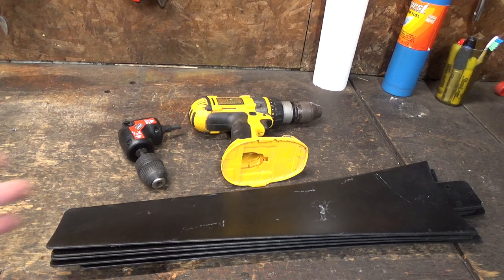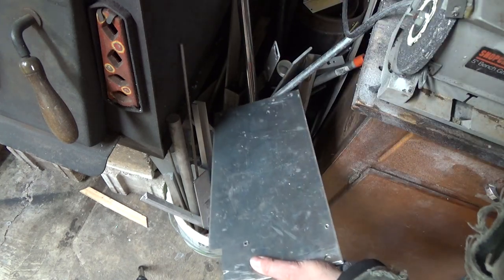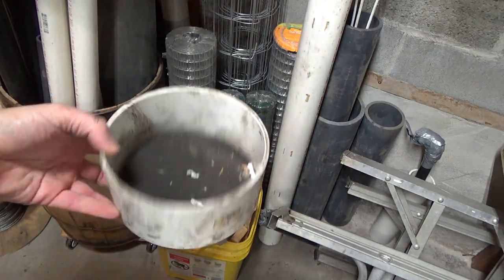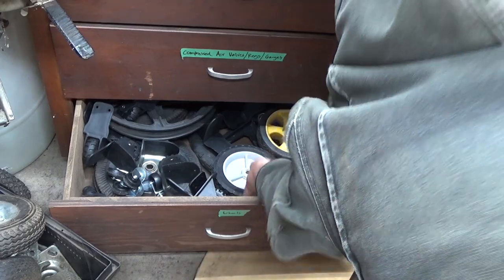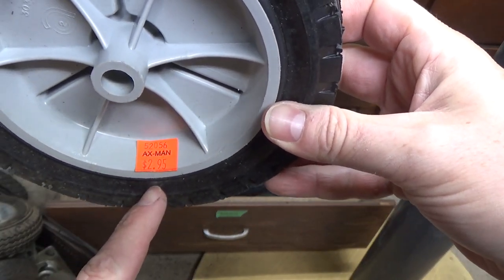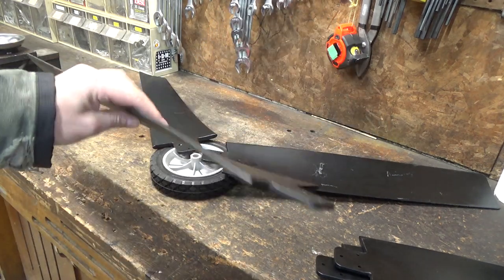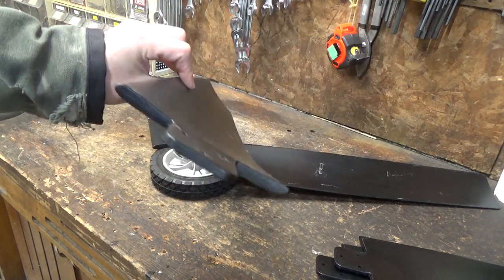We need a tail, we need a circular thing to mount these fan blades on. I could probably make a hub out of a sheet of aluminum from my scrap pile, but that sounds like a lot of work. I'm going to see if I can find something circular already. This might actually work. I should mention I didn't buy these fan blades — they're scavenged from my work off an old ceiling fan. They're not quite correct for a wind turbine because the curve is aerodynamically slightly wrong, but I think they'll still spin around in the wind.